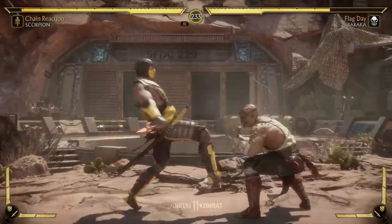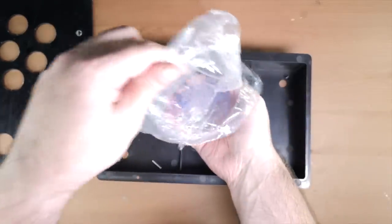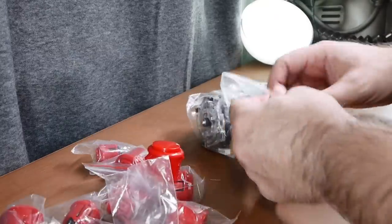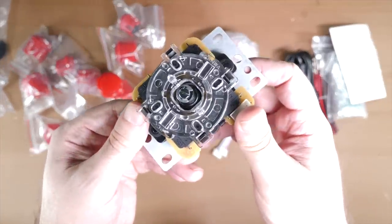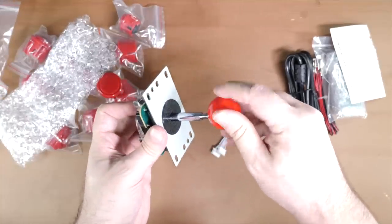Now there's a lot of choice out there for arcade sticks off the shelf, and many of these products are decent enough for most people on their home consoles. But I wanted something that felt like the sticks I grew up on. The fact is, most of these modern decks you buy off the shelf have the quiet but disgustingly mushy Japanese-style Sanwa switches, or at least a close clone. The joysticks are often of lesser build quality and frequently far too sloppy for my tastes — I prefer a heavier spring. These off-the-shelf control decks are also pretty damn expensive, mainly because of the economy of scale.